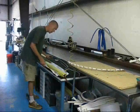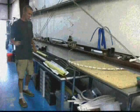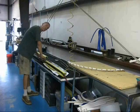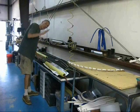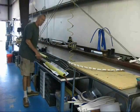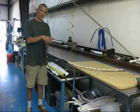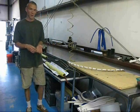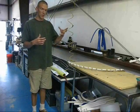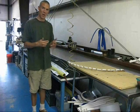Close the bend station. From time to time you're going to want to check the pipe and make sure you turn it so that the bender stays on the bottom. It will always heat the part closest to it the most. So even though it's heating the entire space, the point of positive contact is definitely going to cook more. To avoid grill lines and uneven heat, keep rotating that pipe.